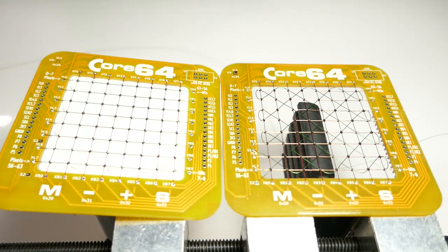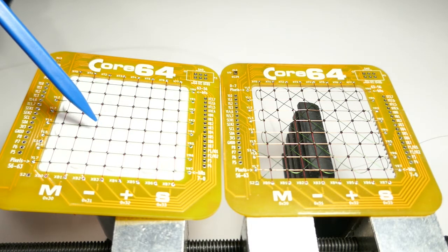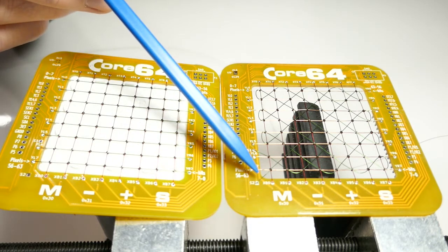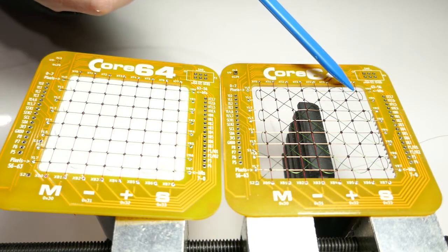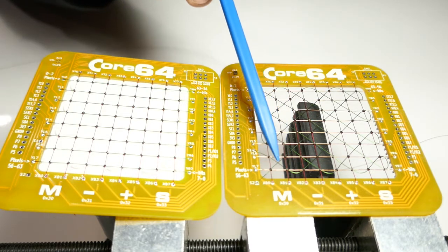The last major step of the weaving process is the sense wire. So I've got a completed board over here, and I've got the weaving fixture inserted and taped into the back side of the board that I'm going to demonstrate on here next. Just to go over where we're headed, this is the sense wire, and it's going diagonally and looping around, and it's doing all the diagonal paths. It ends up coming out here.